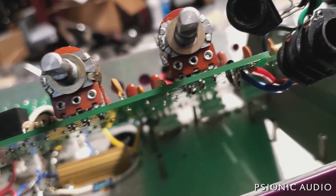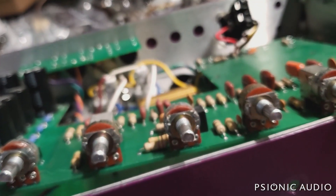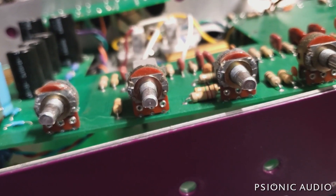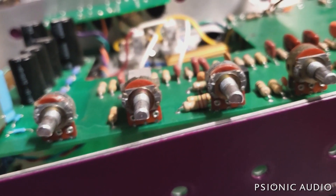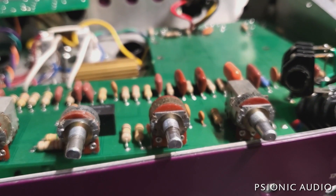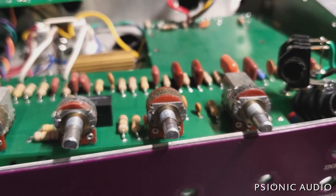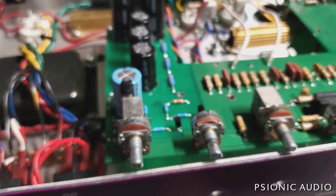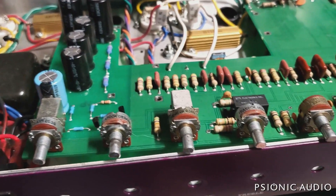None of the hardware holding the pots to the chassis was really tight — some of the pots had glue as well. It's possible that was the issue. Before I go any further diving into the amp, let me make sure he's just not having problems with his speaker or speaker cable. Nothing's wrong with the speaker, or at least there's nothing wrong I can find.